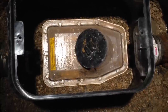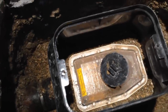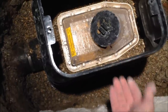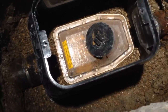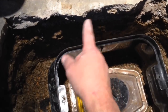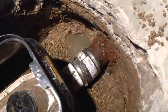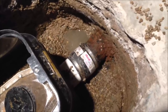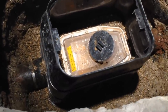I came just below the top of the clear plastic access cover. Now I'm going to put some of the old clay back around the outside, but I want to put the gravel in first so it doesn't cave in or mess things up. I need to make sure I don't bump this too much so I don't lose my elevation. I'll fill it in gently on each side and come up to about six inches below the top. On one side I'm going to use clay; on the other side I decided to go all concrete all the way down — I need that to be as strong as possible. Maybe right, maybe wrong, I don't know, but I figured it can't hurt. So I'm going to shovel some old dirt back in there and get it where it needs to be.